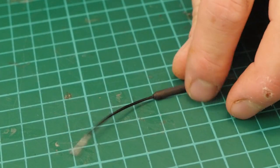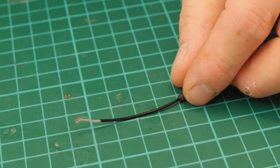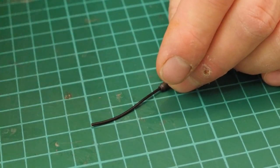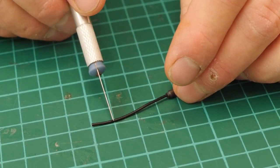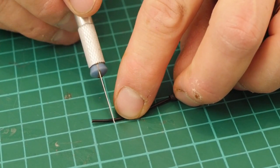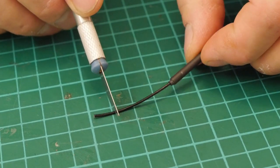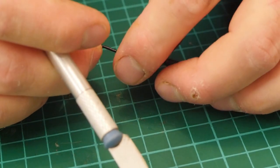For this demonstration I'm going to show you with this antenna where the UFL connection has been broke off. Just pretend the end here is all busted. You want to try and cut as close to the connector as possible - cut through the cable nice and straight and cut that edge off. Then come down about a quarter of an inch - that's not quite a centimeter. Don't lean into the cable; hold it and roll it across so it just barely cuts through the black insulation.